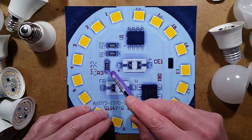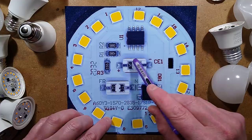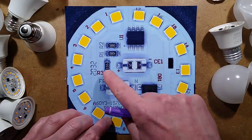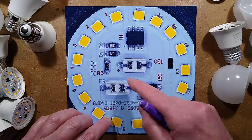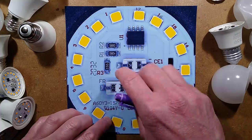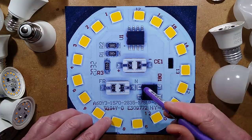That then powers the current regulator circuitry. There is also an unusually high 1.5 megohm resistor across the capacitor. That does two things: when you turn it off, the lights go out decisively - without it, the lights gradually fade down very slowly. It also means that if there's slight current leakage through switch wiring, it reduces the risk of the lamp glowing at a low level even when turned off. LEDs are so sensitive they do that.